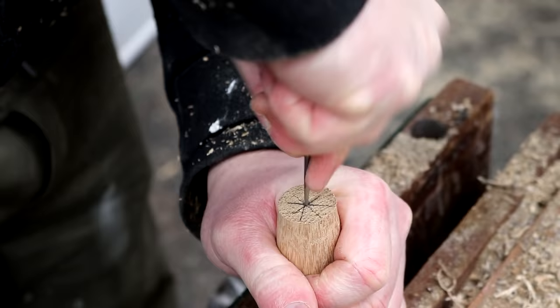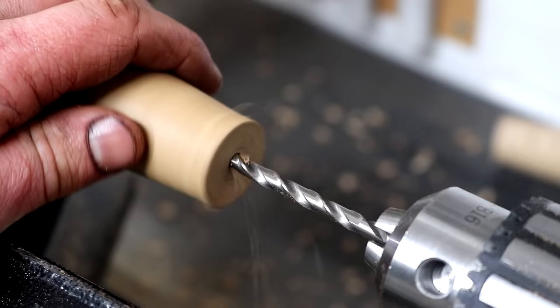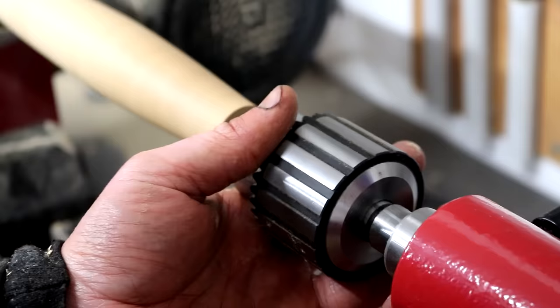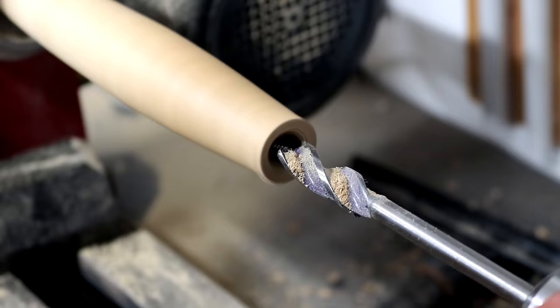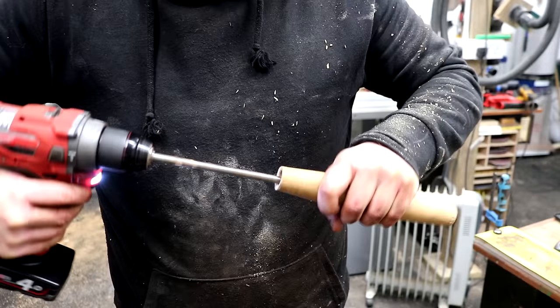I could find the centre again on the handles ready to drill out for the tangs of the shears. First I fitted a 5mm bit just to drill a pilot hole, then I used an 8mm bit which matches the narrowest part of the tangs, drilling the whole length of the tangs. Then I drilled a few more holes just part way through at 10mm, 12mm, and then 14mm to create the taper. I did a quick test fit and it looked like I needed to take a tiny bit more out of the very end, so I did that using a long 8mm bit.